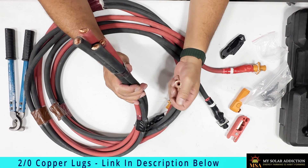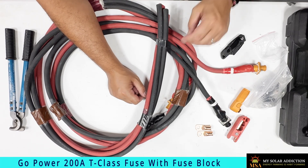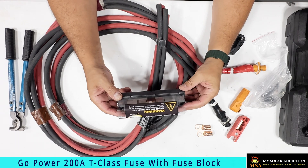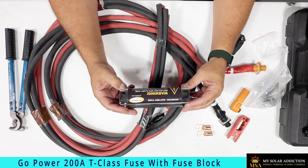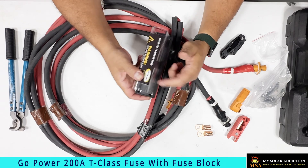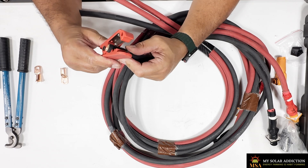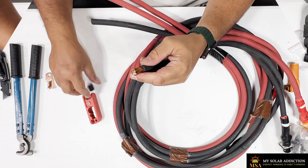My positive is going to need a 200-amp fuse on each part of the run — so that's two fuses. I've got one of them; the other one is on the way and should arrive tomorrow. The fused positive will go from the battery connector to one end of the fuse holder, and then from the other end to the main bus bar.